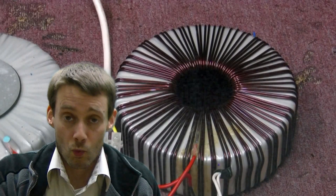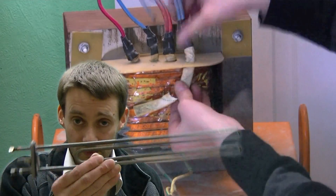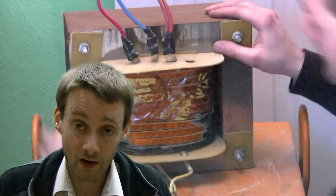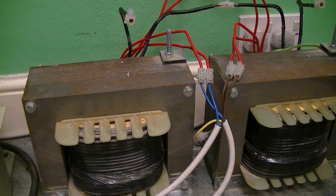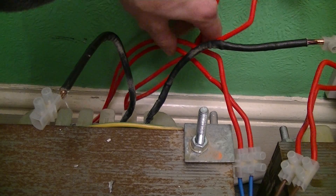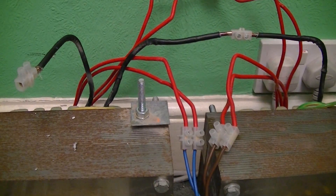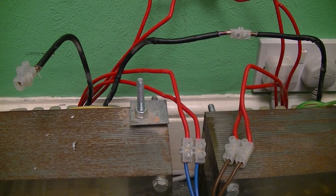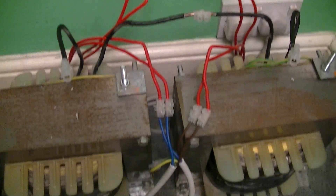So it's not really going to do this. What we need is two 10kVA transformers like those, and then we can have 440 volts but 45 amps or so - I think that's enough to destroy one of these heaters. There's our variac, slightly overloaded, and two 10kVA transformers - primaries are in series, secondaries are in series. Originally these black ones with a 240 volt input and the reds with a 110 output. The two 110s are in series and we're putting 240 volts in, so each transformer gets roughly 110 volts, which is normal. The secondaries are also in series so we get 480 volts coming out, and as I say, 20kVA.